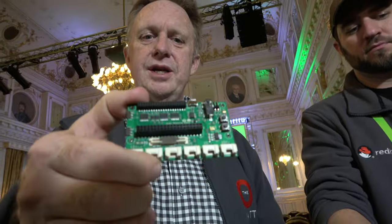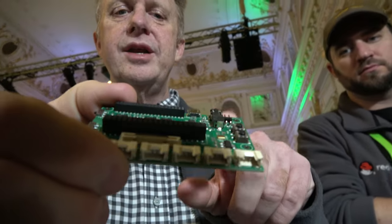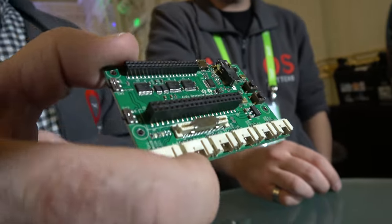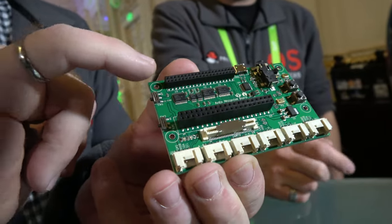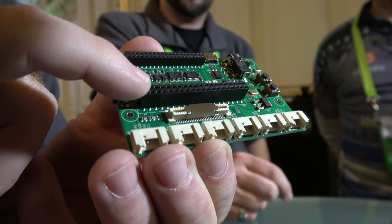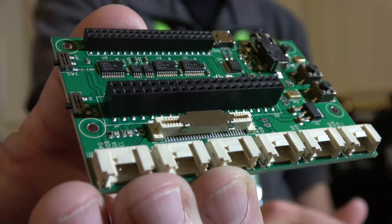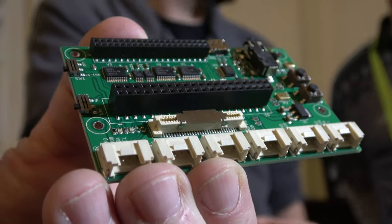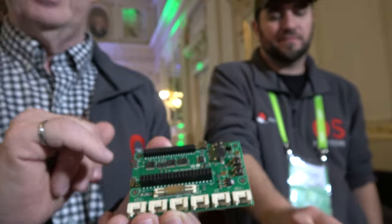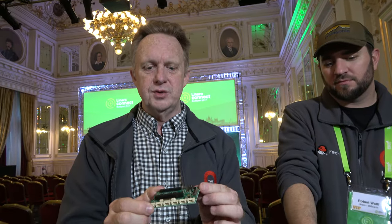This one is an audio mezzanine card. We've added a headset jack, a microphone, and taken all of the low-speed connector peripherals and brought them out to larger connectors and level-shifted them up to 3.3 volts, because a lot of makers have legacy hardware that runs at 3.3 volts, whereas 96 Boards runs at 1.8 volts, which is where all the new sensors will be.